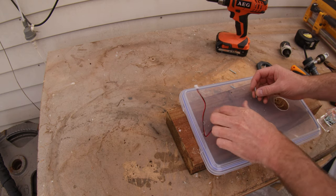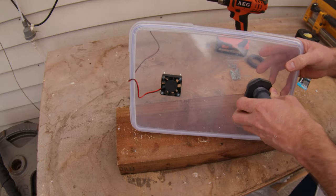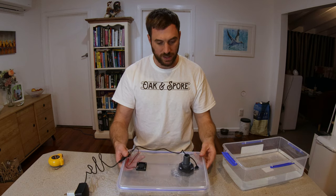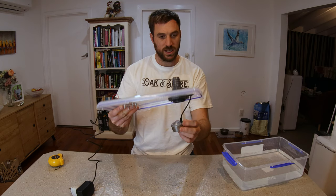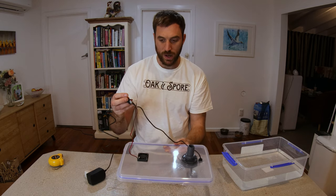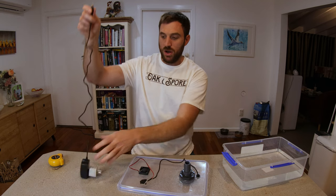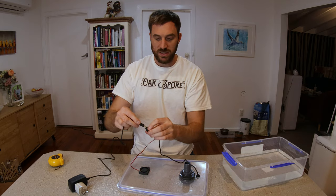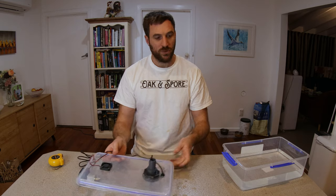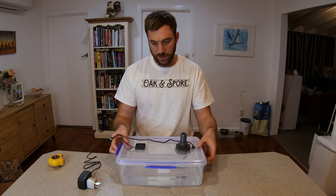Ensure you leave enough plastic around the edges of the holes to drill some holes for the screws — those holes must have some plastic around the edges for purchase. Screw them in and then affix your bulkhead. So we have completed the lid. The humidifier device runs through the lid and there's a rubber bung on it — I drilled a hole and it was able to squeeze in and hold nice and firmly. Both the positive wires I soldered together and the negatives, and I used a little clip to connect them to the 24 volt transformer. So that plugs in and powers up the fan and the humidifier underneath.